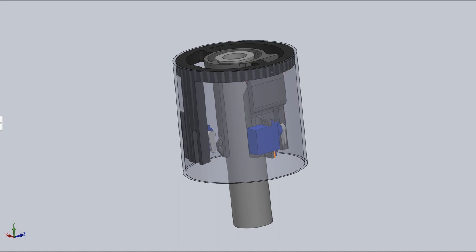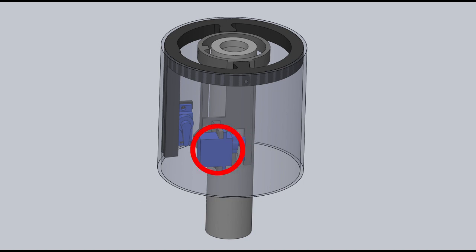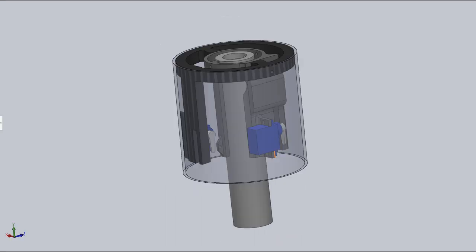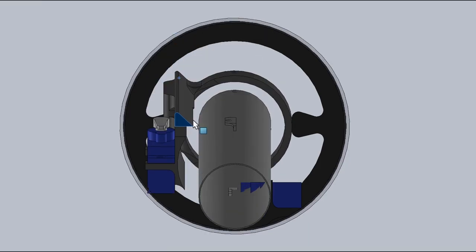All I did was I thickened the platform a little, and I shifted it to the right. This was another problem I found while redesigning. The servo arm in the old design is aligned with the middle of the motor mount, meaning the rest of the servo is way off to the left. This would be fine if the servo didn't have to move, but the inner ring has to move side to side. If it moved left, it would just run into the body tube. Now the servo is near the middle, so the servo arm is off to the right. You can see that now the inner ring can move side to side, and the servo doesn't get close to the body tube.